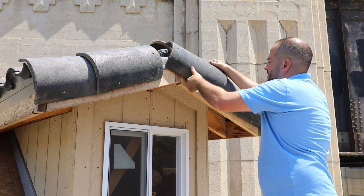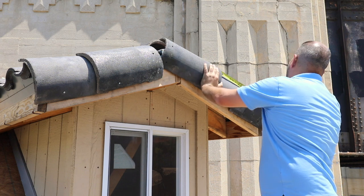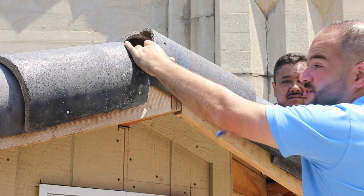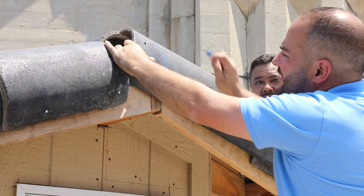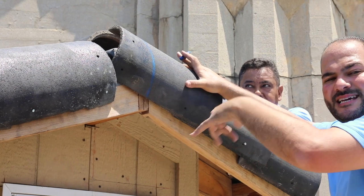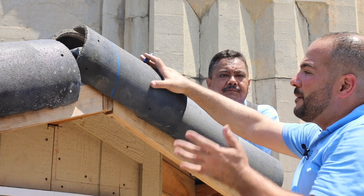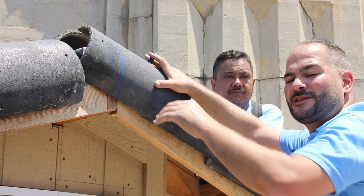This is the area that's going to take a little bit more time. Number one, I want to make sure that I have my tile properly laid out — so again, I have an 11-inch reveal. What I generally like to do, especially on these curved tiles, is eyeball it to where I want it to be. Cut this first tile, then use this as a guide to cut my second tile. You're going to need to finesse it a little bit — you might have to shave one down a little bit, cut it down a little bit more to have a nice snug fit. Because of the fact that it's rounded, it's hard to get it on the first shot. So I like to eyeball it, cut it, then adjust as needed.